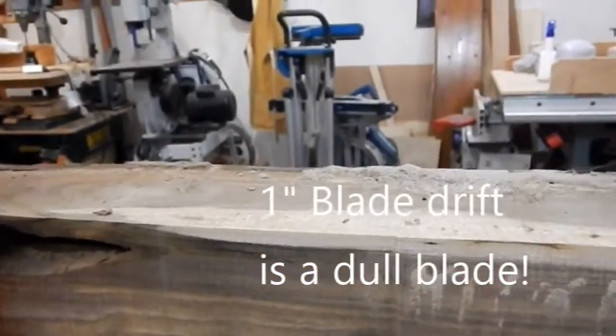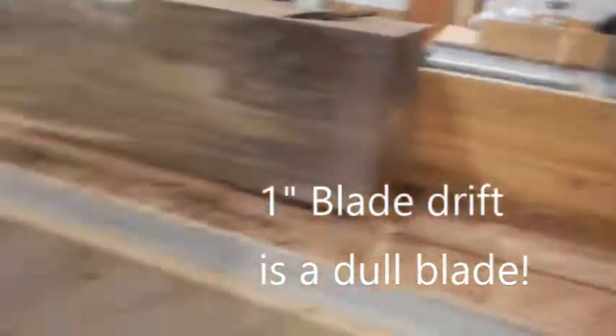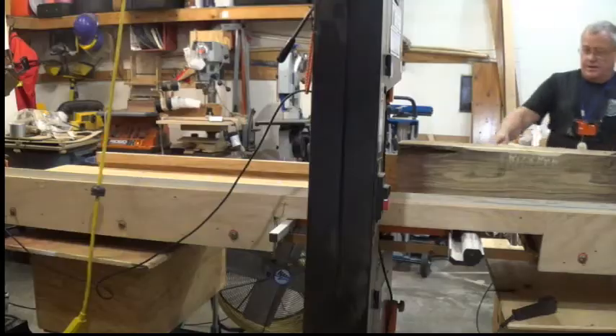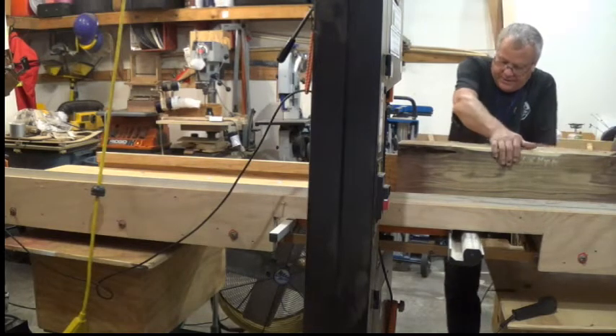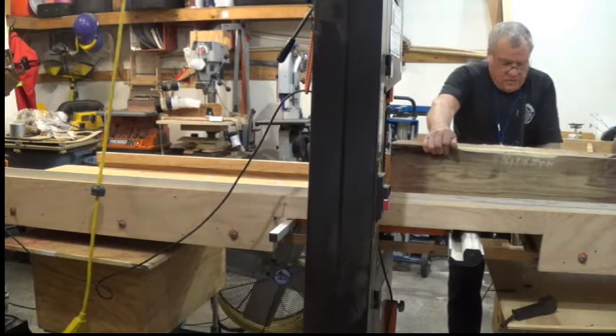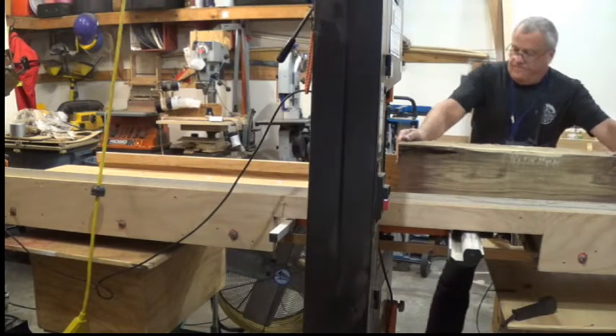And there she is. It's kind of funny — you can hit different parts of wood where it gets hot and hard, really hard. So it's a project. We're going to go ahead and sticker this and get a couple pieces of wood out here. I generally will vacuum this and vacuum the wood before I sticker it, and then I'll wax it. I'll dip it in wax on the end so that it doesn't check. Now all we're going to do here is slide this up an inch. As these logs get a little bit lighter, they move a whole lot easier.